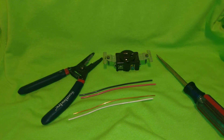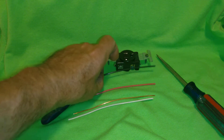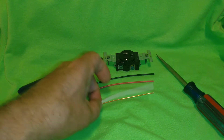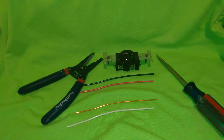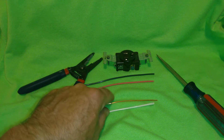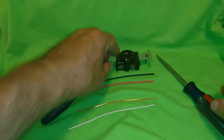Here in the country I'm born in, we have our color code. We have black which is live, red which is live, white is neutral, and the bare ground is ground. Where you have 208 volts, blue is another live conductor. I'm going to show you how to put wires around the screw on an outlet.